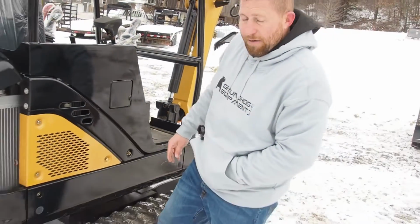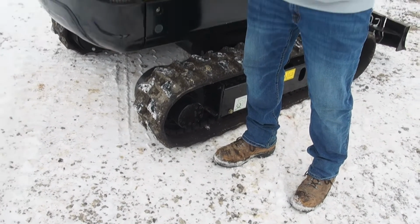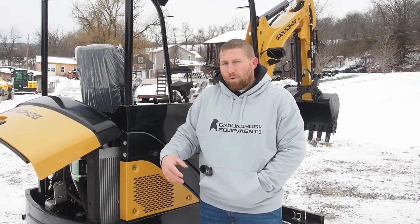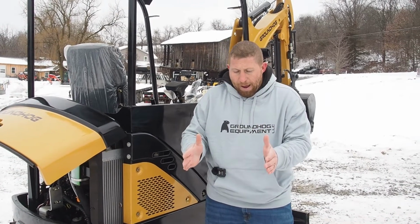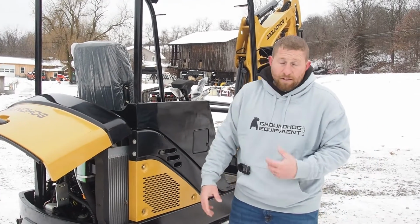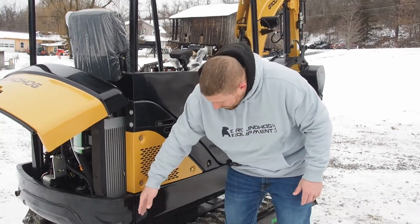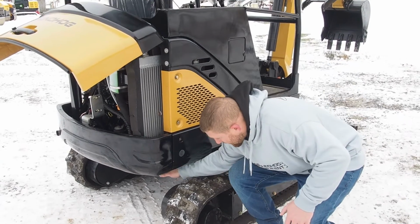You got 2-speed drives, and everybody that looks at these drives, a big comment that I see in the Chinese excavator forums and so on is having an exposed drive, and why some of them are exposed and why some of them are centered and why some of them have shields and so on. So with a single speed, the drive motor is sitting on the back and you just have a spindle and a drive sprocket. Compared to this one, it has gear oil and everything that runs through it, and the drive motor is centered in that motor so that the sprocket is centered on that motor. So you have shields and stuff, but you have a smaller tail that your drive motor is not sticking way out.